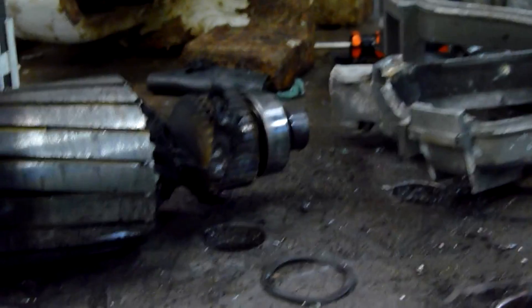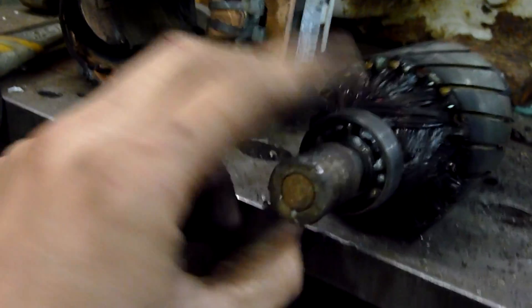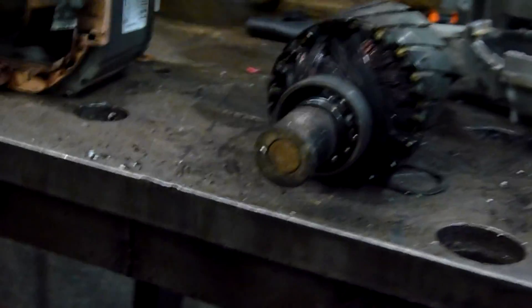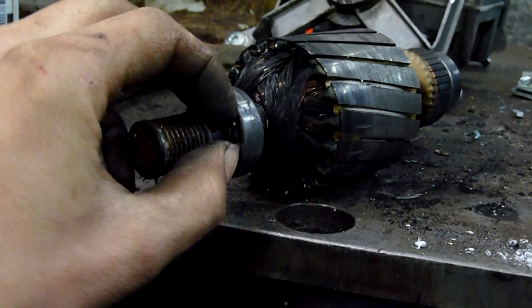I'll sabotage the commutator end on the next motor — dry it out, rust it up a bit forcibly. And maybe drop some silicon carbide dust into it, since it's such a nice bearing eater. You can almost knock that off and drop all the balls out of it.